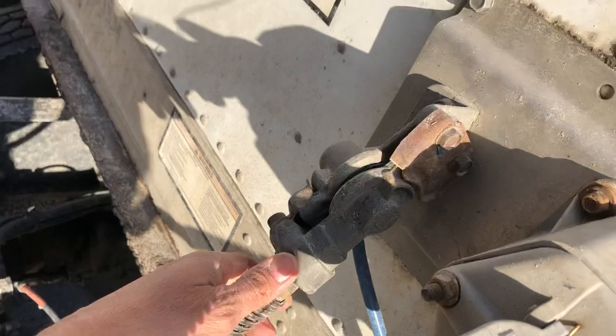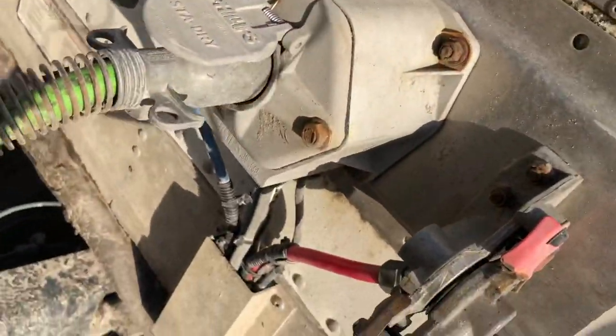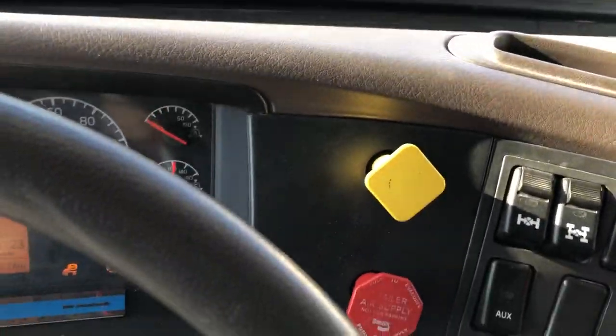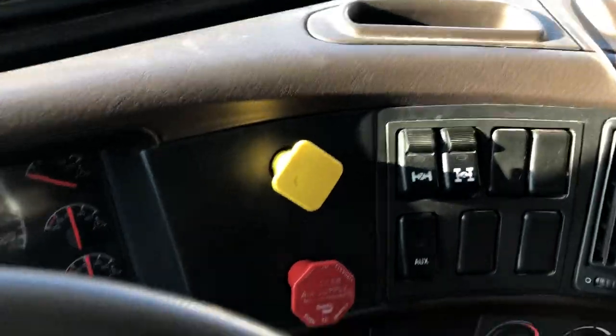This is my blue service line - take it off here and leave it here. Then I am going to come in and release my tractor spring brake and build the maximum pressure.